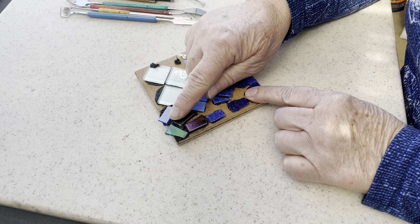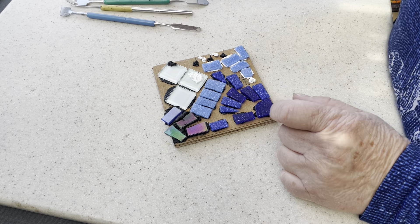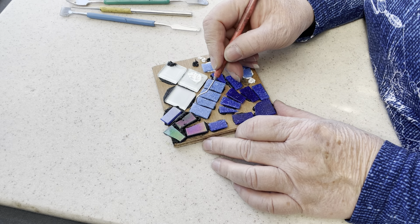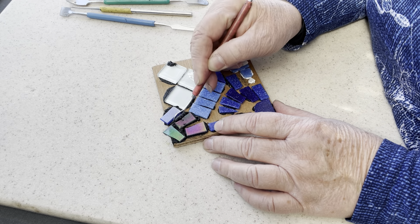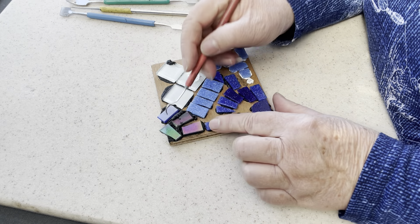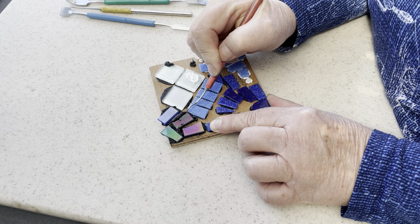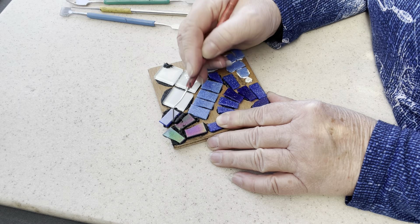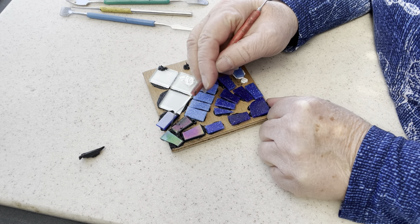So let's have a look — the favorite bit! Look at this incredibly disgusting chunk here. What's important when you're cleaning is that you have to leave enough space to fit the grout. Grout is not an adhesive but it does need space to fit. If the glue comes up less than halfway between the tile I don't bother removing it, because there's plenty of room for the grout. But clearly here there's absolutely no room for anything — this would represent a really bad hair day. So often with just this bit I can go in and slice or cut the glue with this little tool, cut the other side, then use the pokey push-me-pull-you part to just pull it out. You can see the great big glob coming out — you can just grab it and pull it off.